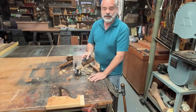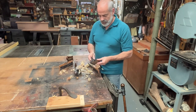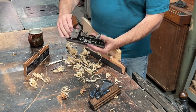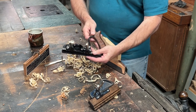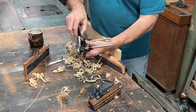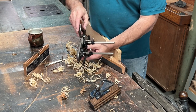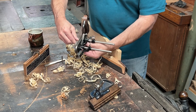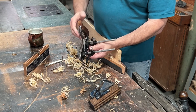This is a plane that you have to get used to. It's not as comfortable at first as the 50. The 50 has a depth adjuster, which the Record doesn't have, so you can move the iron back and forth. But to do that, you have to loosen this wing nut here, which loosens this structure and gives you a little bit of slop in the iron. I don't find it too easy to adjust the iron in and out once it's loose — I don't think it adjusts as finely as it should.